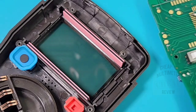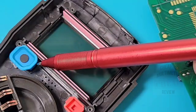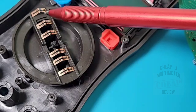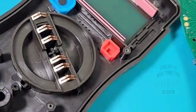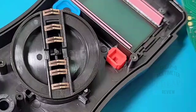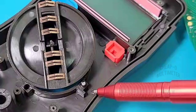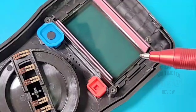At the top of the board is the transistor tester inlay and the on/off switch hiding beneath the display strip - that's where the main IC lives. Here are the zebra strip headers making contact with the PCB surface to give us the display reading. We also have a couple of soft-touch buttons and the pads that contact the selector switch. This is one of those older-style varieties with the ball-and-spring mechanism - you can see one of the balls just hanging out there.